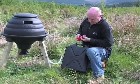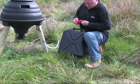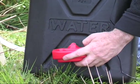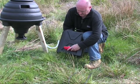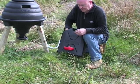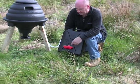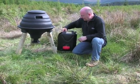The filter is screwed off the end, and then the locking nut is screwed off. We basically put that into the 1/2 inch hole, put the locking nut on to secure it and create a watertight seal. There we are. Very, very important. You've got to put the filter on, because if any contaminants get in there, there's a small valve there and it might block, and you don't want that to happen. So put the filter on, and there you are.